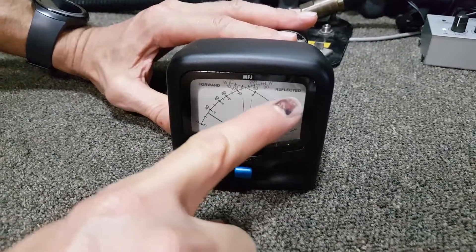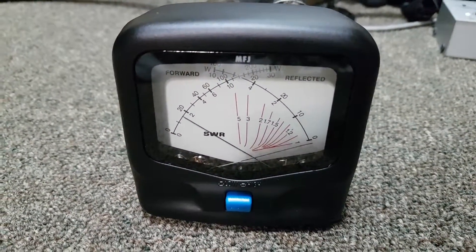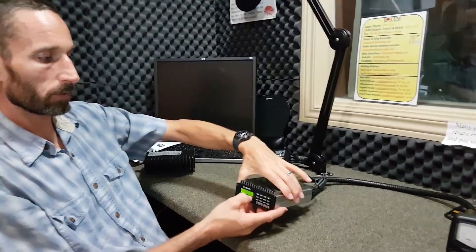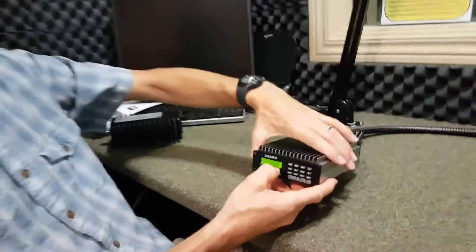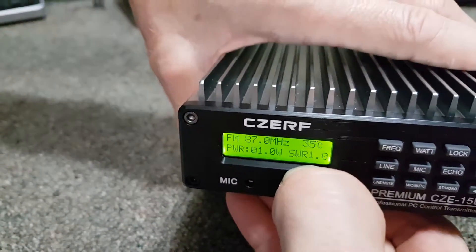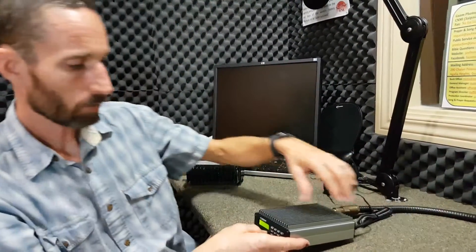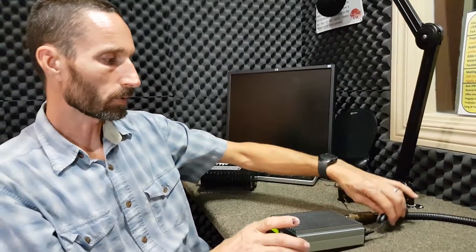On the right side of this meter it shows reflected power, and right now it's hovering right at zero, which is excellent. The SWR reading here on the transmitter is 1.0, and that's a good reading. If that reading gets above 2.0, then you're having some kind of issue with your transmission system. With the dummy load connected it should always be really low - unless there's a problem with the coax or connections. But with your transmitter hooked to your antenna, if that number is high, there's some problem - probably water in a connector, which can cause power to be reflected back to the transmitter and cause damage over time.